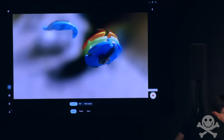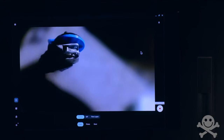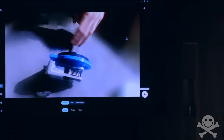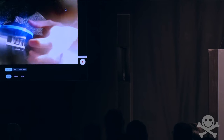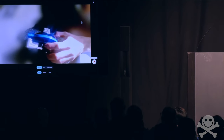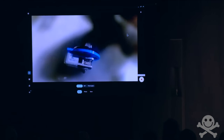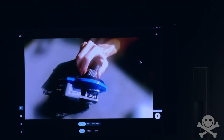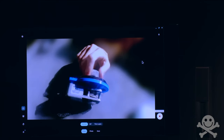If I can get the camera to show at least somewhat, I can show a little example here. We are looking at the top of the lock. You can see there's a bar — that is the fence. Behind it, underneath it, are the wheels. When you dial the combination, it will line up each of the gates underneath that fence.